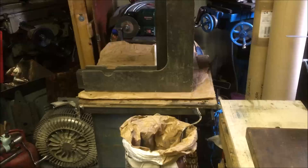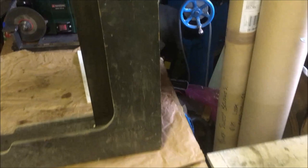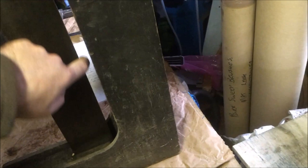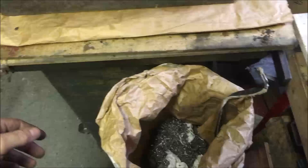In order to measure that accurately I want to measure a foot of travel, giving me half a thou at a foot — which at half that distance is about two and a half tenths, near as damn it. So I need a bigger T-square. Some while back I spotted one on eBay for £25. It arrived in its wooden case — I've not even had it out. I know it's certainly not going to be accurate to two tenths, so first I need to get it out, clean it up. It actually feels quite smooth with no dinks on it — we might be in with a bit of luck, though there's a bit of residue on the base.